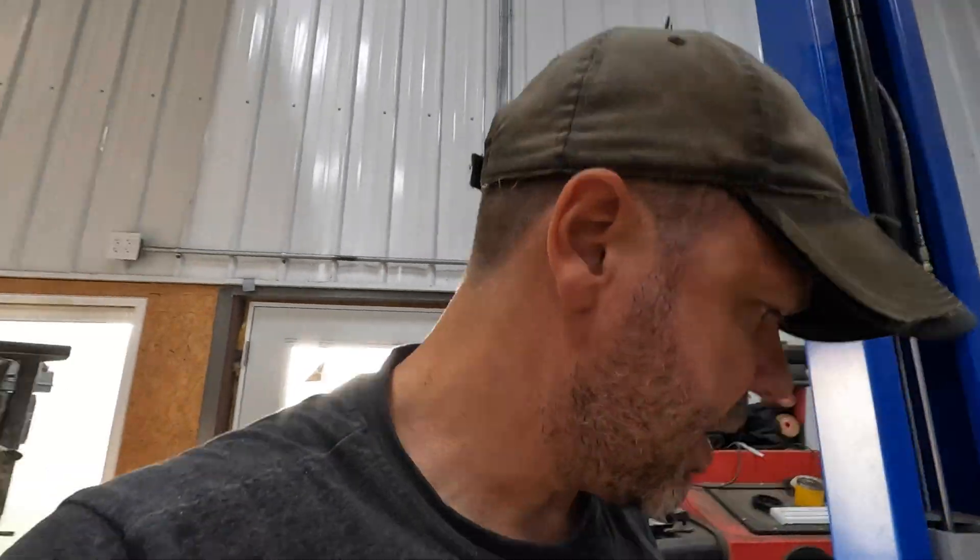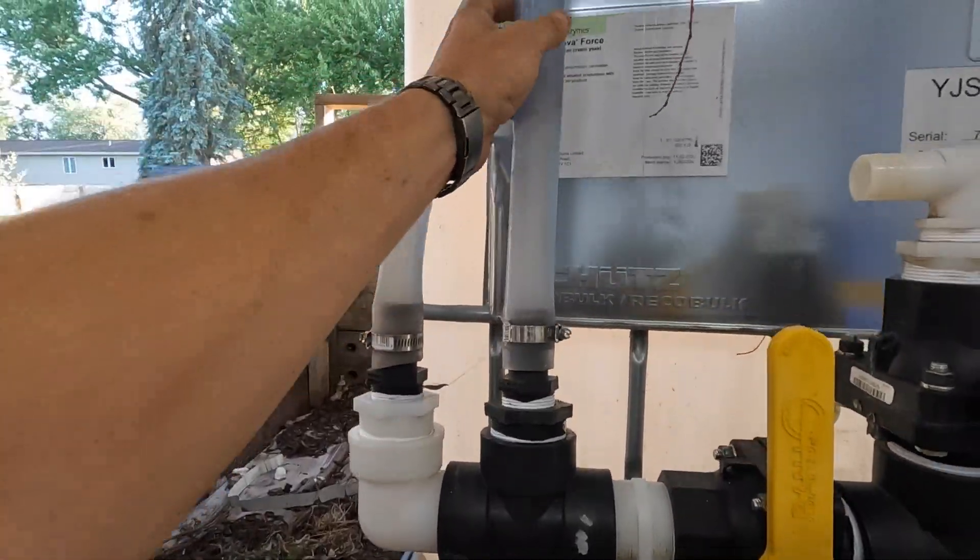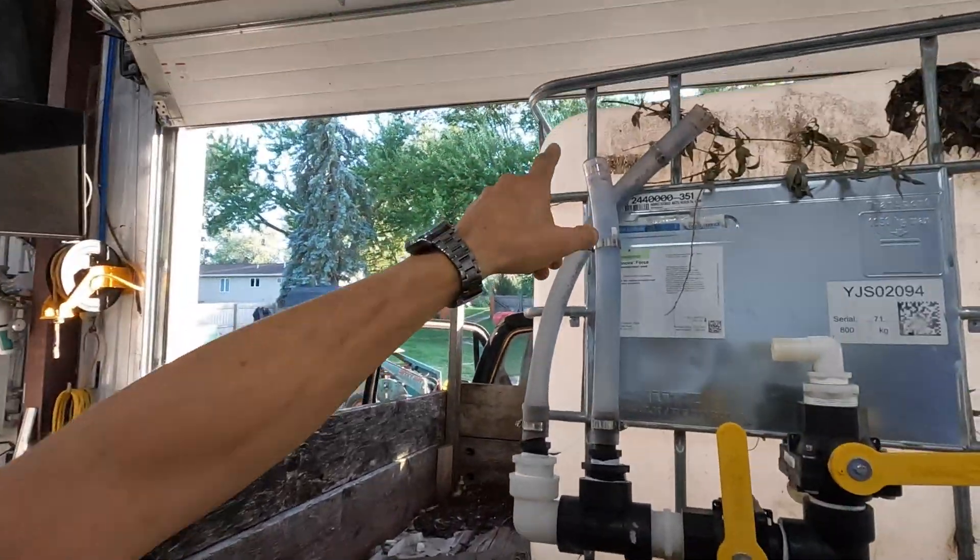We should have a union with some vibration reduction so one doesn't shake the fittings on the other. I'll get a nut driver and get that tightened down, then get the motor bolted down. We're going to need to cut more feet of this hose — this stuff's old and I'd rather have these kick out a little further. Then we'll cut some holes in the tank for the bulkheads.